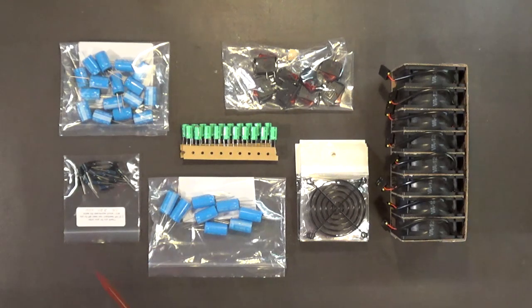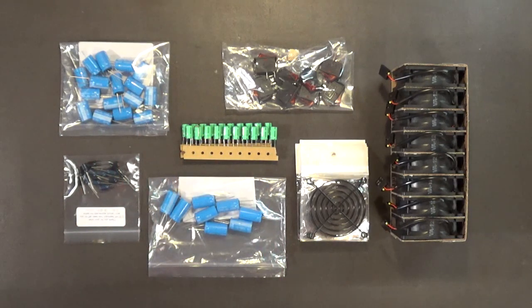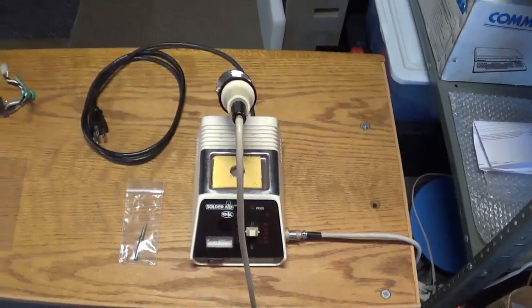These capacitors are all made in Japan, extremely high quality, rated at ten thousand hours or more — that's a very high quality rating for an electrolytic capacitor. I was looking for 105 degrees C temperature rating, but I found these were also available in 125 degrees C, making them really high temperature capacitors. These are perfect for recapping an Amiga 2000 power supply.